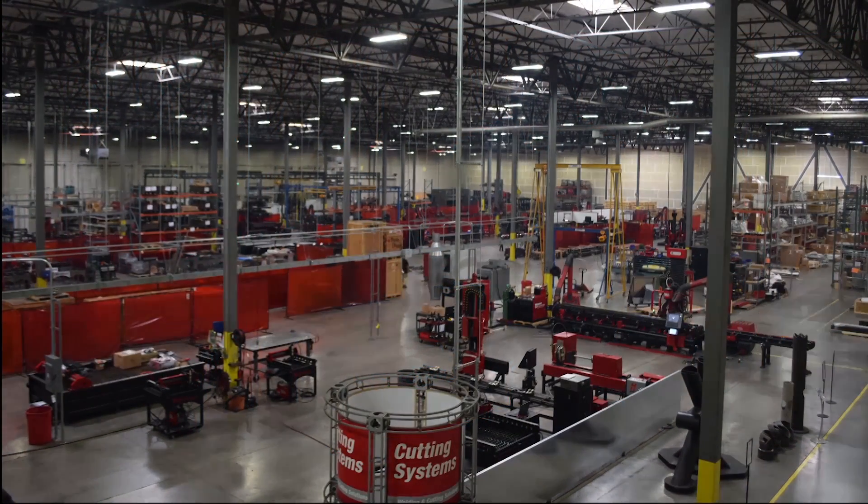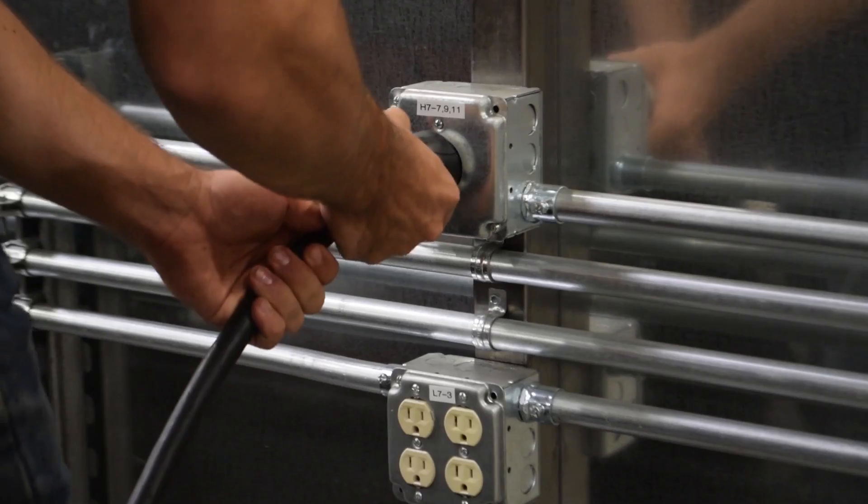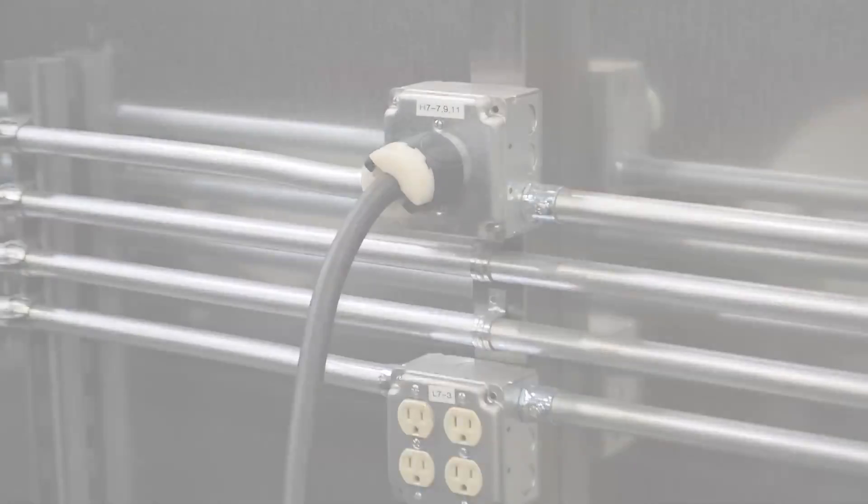Commercial buildings offer a second source of electrical power that expands your conventional plasma cutting beyond 100 amps. It's a three-phase electrical configuration that allows you to cut one-inch thick mild steel while still maintaining a fairly good duty cycle and longevity in consumables.